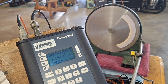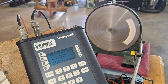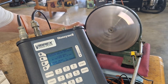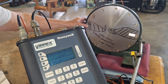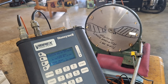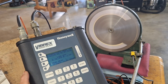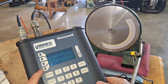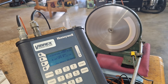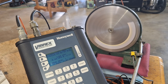We wouldn't try to balance this on an airplane — that's well over the limit; something would be wrong with either the engine or propeller. But if this was a fan in your living room, you'd balance it. What you do is put a trial weight opposite the heavy spot. We know it's at two o'clock, so we'll go to eight o'clock. Since we know we can fix it, we'll put on half the weight — I should get roughly half the vibration. Redoing the measurement: 0.43 IPS, so we've removed slightly more than half the vibration.